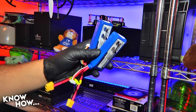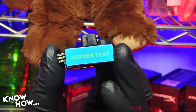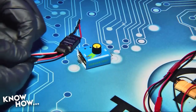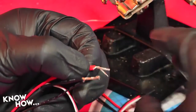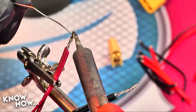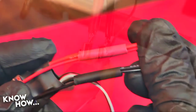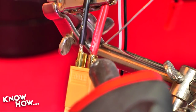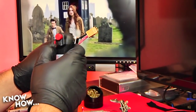The electrical design is simple. The batteries connect to a harness that supplies power to the 12-volt fan and the ESC. The ESC is controlled by the servo tester. Depending on the position of the tester, the ESC will send up to 11.1 volts to the Peltier cooler — this gives us control over the amount of heat being drawn out of our gel pack. I created a wiring harness, binding the XT60 to the ESC, black to black, red to red. I also gave myself an accessory connector after the ESC for later use. Finally, I added an XT60 connector for the Peltier leads coming out of the ESC, and a JST connector coming from the harness before the ESC — these will be my detachable connectors to the Peltier and the 12-volt fan.